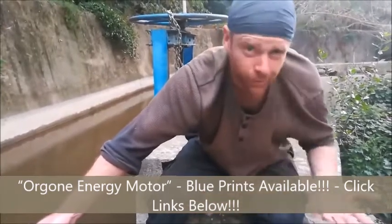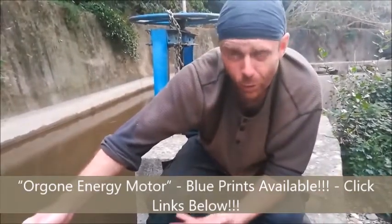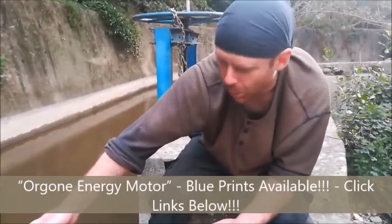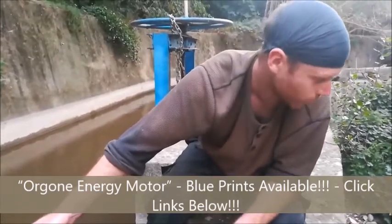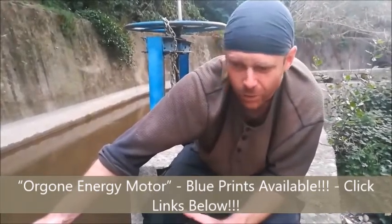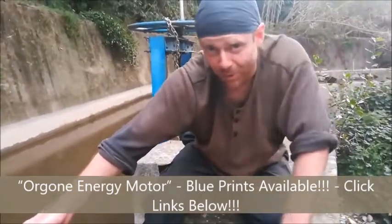If there's enough water flow, but there should be, because the full system power of this is about 1.2, 1.3 kilowatts. So even if we're only going at like 40% efficiency overall, which is hopefully more, that's still like 500 watts right there. That times 24 hours a day is 12 kilowatt hours, which is enough to run about 2/3 of a western suburban home. Everything here cost about €40.